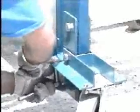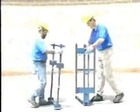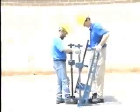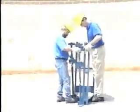Attach the top of the extension sections to the stirrup and connecting frame with the provided 2 smaller, longer bolts and nuts. Tighten all nuts and bolts at this time. Place the floor sections inside the work cage and retain them with floor pins. Finally, install your wall roller assembly.